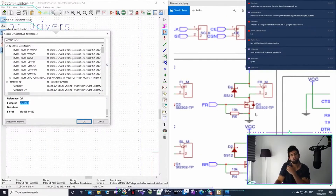So if I send a one here, I switch this on and it gets pulled down - so it inverts the signal. So if you have a circuit where you want to invert the signals at the output, that's for logic control. So let's say I want to invert from a zero to a one - then I'll use a P-channel MOSFET.